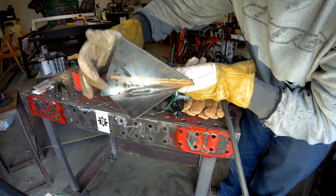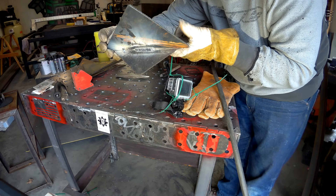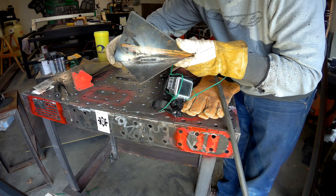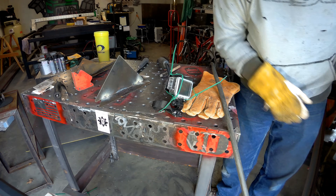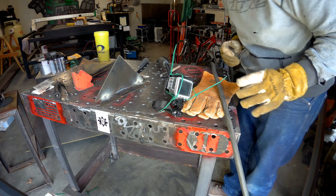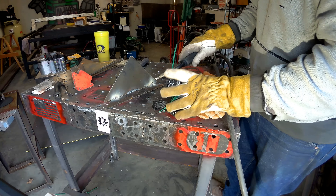Factory settings right out of the box and I'm actually pretty happy with that. I think it's a little fast on the wire, so I'm probably going to step it back maybe five inches per minute and see how that runs. If you're a MIG welder trying to do flux core for the first time, one thing that's going to be a little different is the technique.